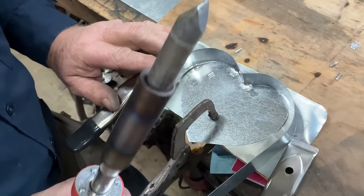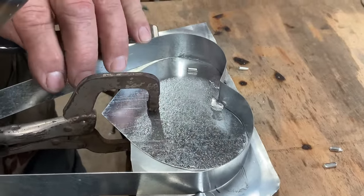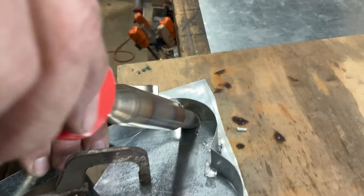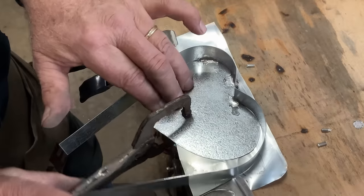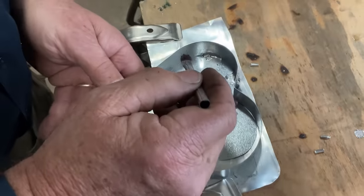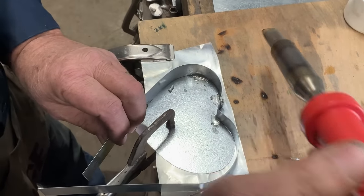A little acid in there. Another little bit of solder. So pulling this around, and that's why we just cut this piece long. We bounce it on our finger. That's how high tech that was. Then we're going to get this over here. Tack solder that in. And we're just going to continue around. This is going so well. We're not even going to slow down around the corners. Got the muriatic acid on. Let's get our iron in here.